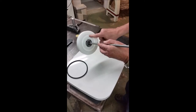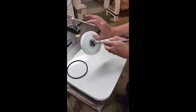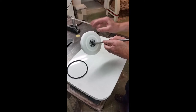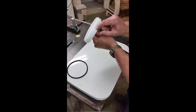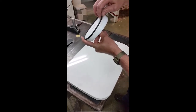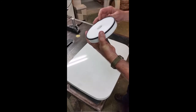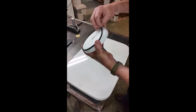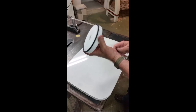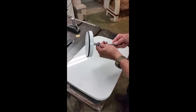I've got a groove in the back that accepts my four-jaw scroll chuck that goes on the lathe. I am clamping against the outside, so this has a little bit of a draft on it so that the more I expand the chuck the tighter it clamps. On the outside there is a little dovetailed area that accepts the o-ring seal — it seals against your wooden part. I just made the o-ring out of o-ring stock. I've got a little dimple there so that I always line this up with the number one jaw on my chuck to minimize any kind of run out.